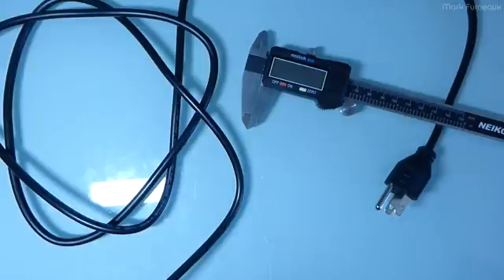I'm going to solder these two ends together and then we're going to go outside, hook it up to a power supply, and watch the carnage. Here we are outside — I've got the cable hooked up to my power supply, limited to 10 amps which is what the cable is quote-unquote rated for. I've got my thermal camera here. There's no output control so I've got the output set to one volt; we're drawing 300 milliamps and the cable is already starting to warm up. I'm just going to increase the voltage and see what happens — I've got it on some cardboard so it doesn't melt all over my deck.